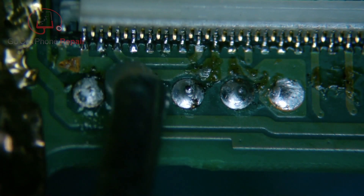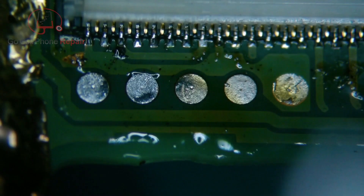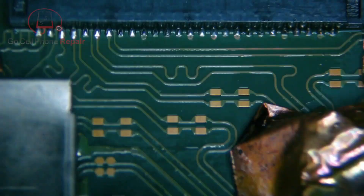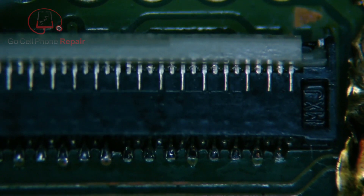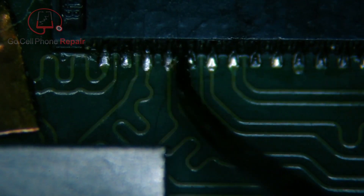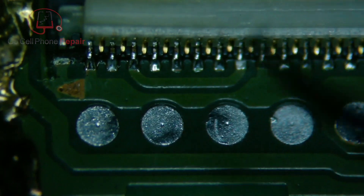We do not need all of this - it's just making it harder to clean. Those are looking okay. It's going to be difficult to make this thing look factory because we can't really go back over and flow them with the hot air, but I believe everything is connected on both sides. We could check with the meter, but I think if you don't see any movement here, you should be confident enough to go ahead and plug it in and test it. And we do have one here that didn't quite take. Once again, ground pins - always fun.